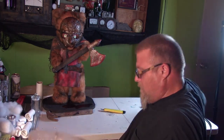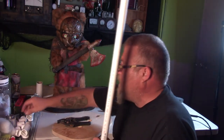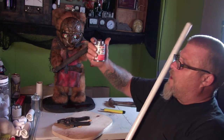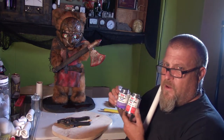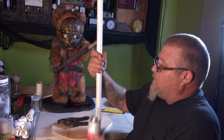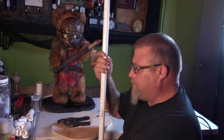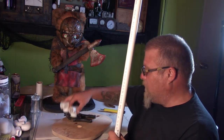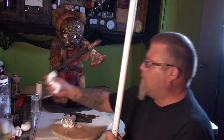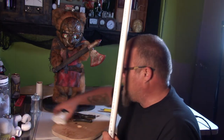I already reamed it out. I got my extra stick of PVC — three-quarter-inch. I bought two sections and ended up buying a bucket of the fittings, which is more cost-effective. And then you're also going to need all-purpose PVC cement. You might find that you have to buy a set that comes with primer — you don't need the primer. The primer is only if you're going to use this for what it's intended for; most people use this for water lines, irrigation. We got our PVC cement and our three-quarter-inch fittings. I'm going to use two three-quarter-inch slip-by-slip T's, and four three-quarter-inch slip-by-slip 90s. If you want to look for 45s, get those if you so choose. That's our material list.